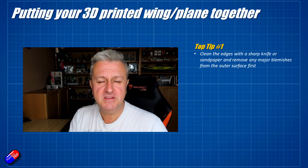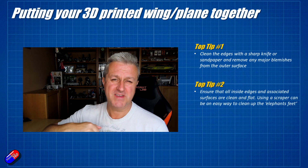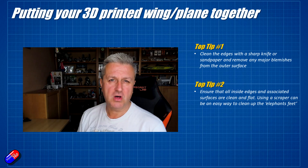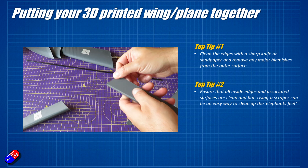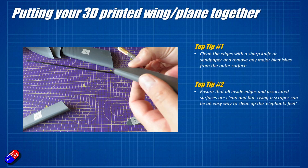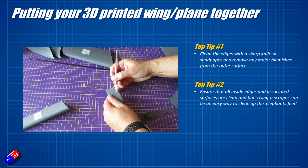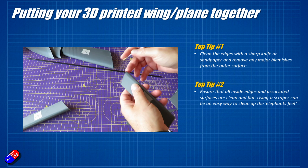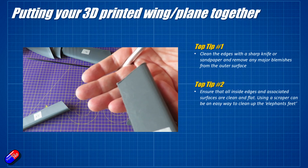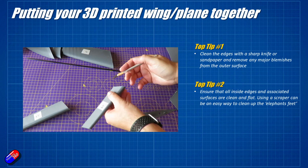The first two tips from Steve are very similar. Make sure that all the edges are as clean as possible. Use a craft knife to remove any blobs of plastic, and spend time making sure the edges are nice and clean. If you can at the bottom of the print where it comes off the print bed there's a little lip — pretty common with a lot of 3D printers — you need to remove it. I was removing it with an emery board, but I found that left little scratches in the plastic. With a nice sharp craft knife — I was using the Exacto — and a steady hand you can remove all of those.